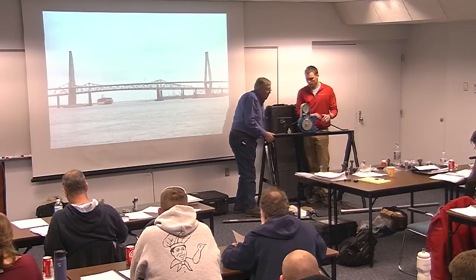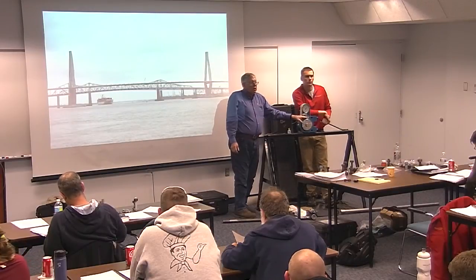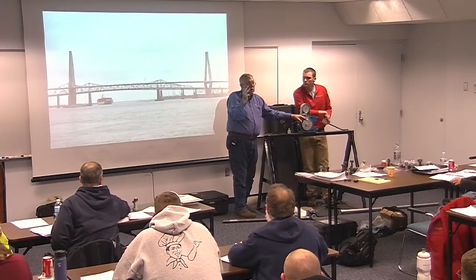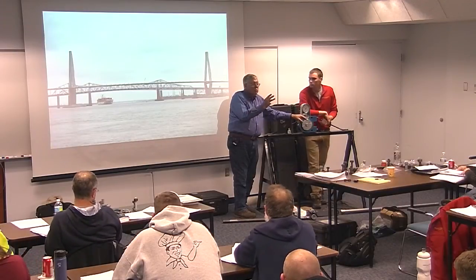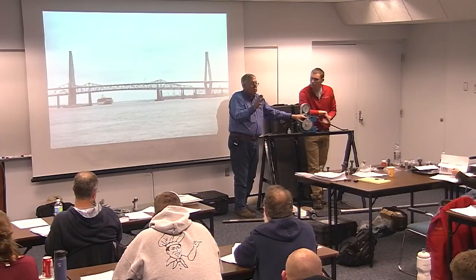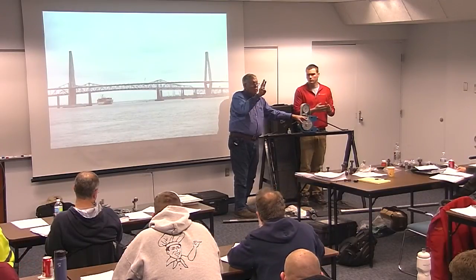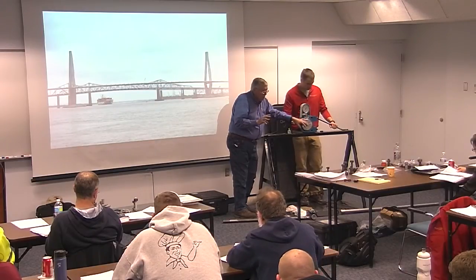Now, what the requirement is, I've got to compress this down. I've got to take it to the point that I can stick the feeler gauge in on the front at 3 locations. And that should be 3 open at 39 kips. Or I'm sorry, at 41 kips. At 41, I should stick the feeler gauge in at 3 locations. So, we're going to pull this down to 41 kips.